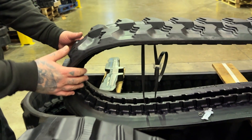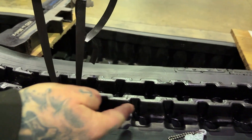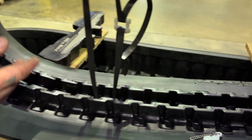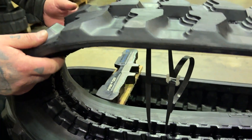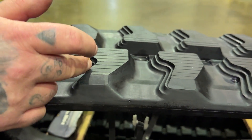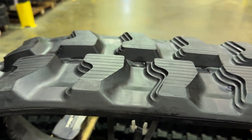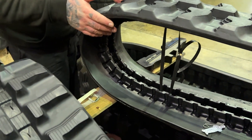This second one is a 48mm pitch and you can see that the lugs are closer together and you get more teeth, which gives you a more comfortable and less shaky ride in the cab. On top you've got the same sort of tread but a bit more chunky — they've got the three steps again so you can get all the dirt out. These are also anti-derail, so you shouldn't have them come off.